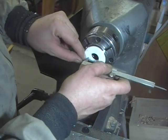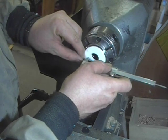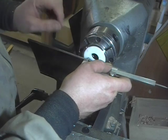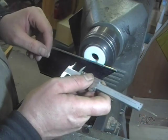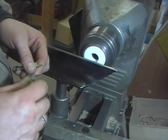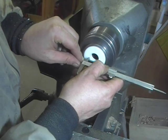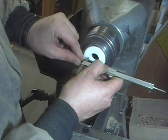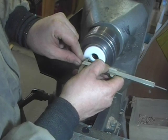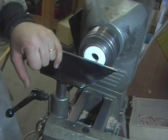So you touch this side, and then you watch on the other side where the line comes, and you move either in or out to get your line about where it's supposed to be. So then you can see you have a reference line. So I'm going to do that right now. I said, what did I say, 26? Okay, so it's 26 right there. So I'm going to come in here, I'm going to touch this side only. See, that's too far in. If I look there, that'll do right there. So now I have a reference line for where I want to make my cut.